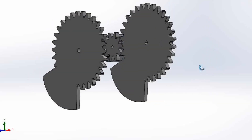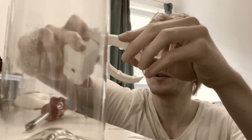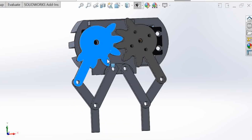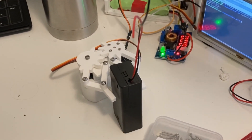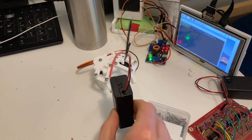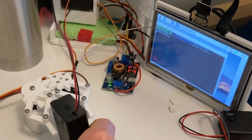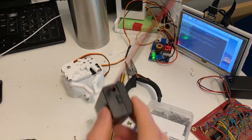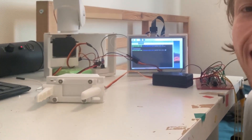But look at it from a different angle — specifically this angle. To get better gripping, all we need is a stronger compressive force, and theoretically we can achieve it by creating a complex gripper of loads of moving parts that I definitely didn't just blatantly rip off designs from the internet — but after all, there's only so many ways to fit the square into a circle. Sometimes my genius is almost frightening. The thing is, it doesn't exactly work very well — it's just that driving gears and arms simultaneously takes a bit more juice than the battery and buck converter can give. If I take these middle arms out though, we get better results. Our power is still a bit iffy, but big step in the right direction. Grip force still wasn't great, so I designed this new one.